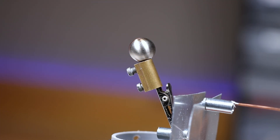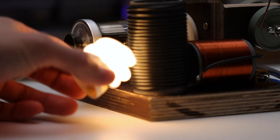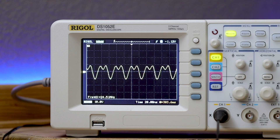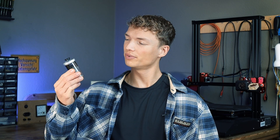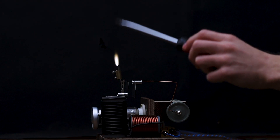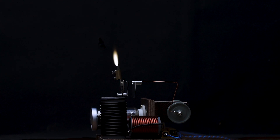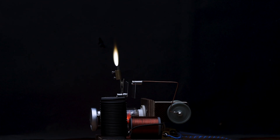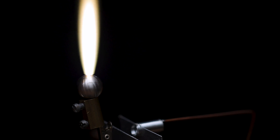I think we are now ready for some tests. For this I first preheat the tube for a couple of minutes. At a voltage of 200 volts the electric field is strong enough to let a fluorescent lamp light up. The circuit operates at about 24 megahertz. I will now show you why the GU50 is a little beast. I decided to use a ball electrode because there you can see the flame traveling around.